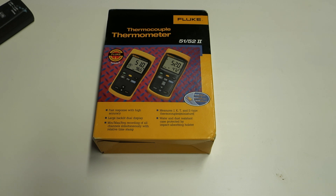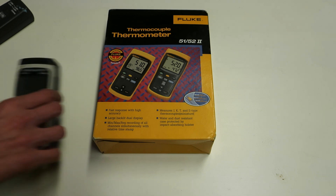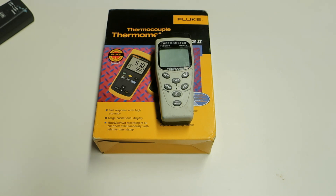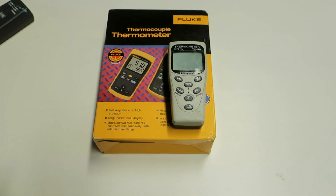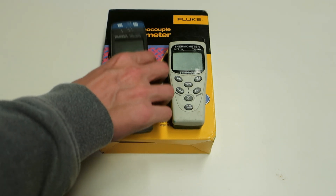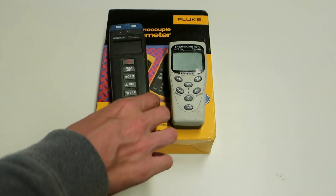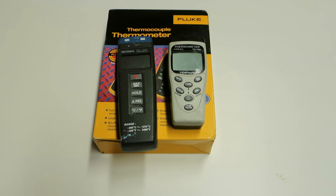So most of the time I've been using the TenMars TM82N, which is a dual input K-type thermocouple meter from TenMars, a Taiwanese company. Compared to common ones like the Voltcraft K-102, it has a bit larger display. I personally would not get a single input meter because they usually cost the same as a dual input one and then you are just limited to one heat source only.